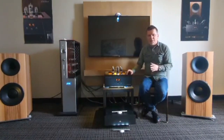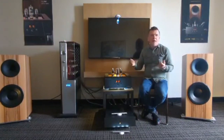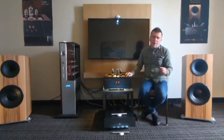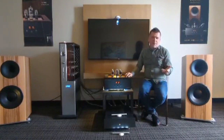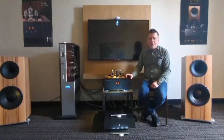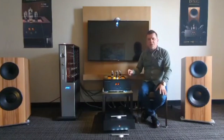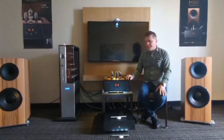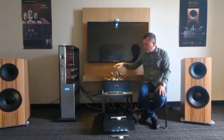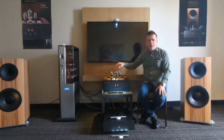we supply the DAC with the most neutral, most balanced, most accurate tubes we can find. You may find it maybe too lean for your taste, or maybe you prefer something warmer, maybe you prefer something leaner, maybe you prefer something more cold in presentation. So rolling tubes allow to match exactly your taste. By rolling, I mean changing, you have to change all 4 pentodes together or both triodes together.